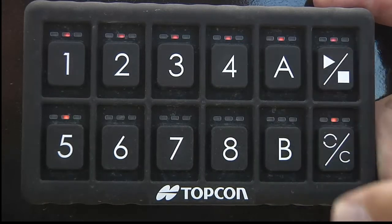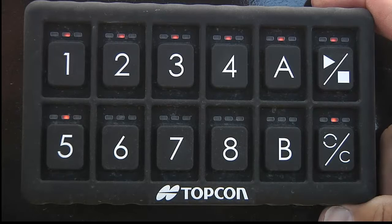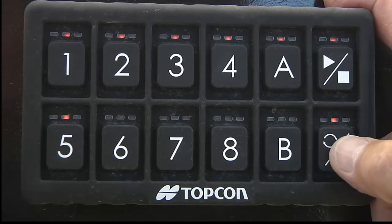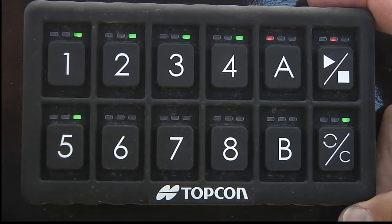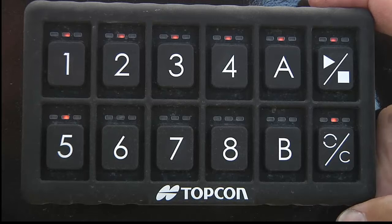Turn our master off, and at this time we can test the prime function. We had entered a five-second prime in the monitor, so if you press button C you'll note the metering augers run for five seconds — valuable for checking runs.